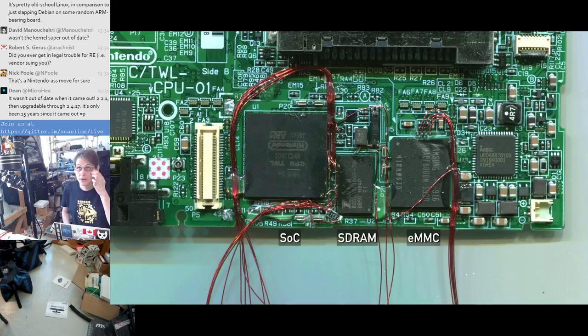It was still interesting to try to figure out, for example, the way they implemented the encryption. It was not very good. There's a secret key that varied per console, and then an initialization vector that varied per memory block. But then you would just take those two things and use them in an AES module to generate a pad of data, which you would then XOR against the block you would be putting into the eMMC. So that XOR pad did not change depending on the contents of the block. So if you made a change to the flash memory and then wrote it and then diffed the flash memory both times, the XOR of those two diffs, even though the diffs are both encrypted, is identical to the XOR of the plaintexts. So I almost had an exploit based on that.